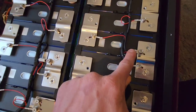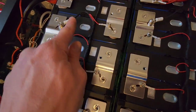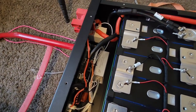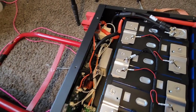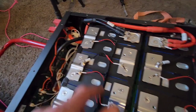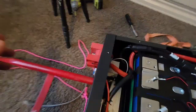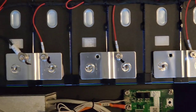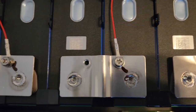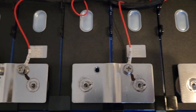There are four temperature sensors inside. Here's the pre-charge resistor, so when you hook up to your inverters it won't blow capacitors and things. This all looks really good in there. Looking at these cells, it doesn't look like any of them are expanded — they all look pretty good. We'll see what they look like once they're frozen.